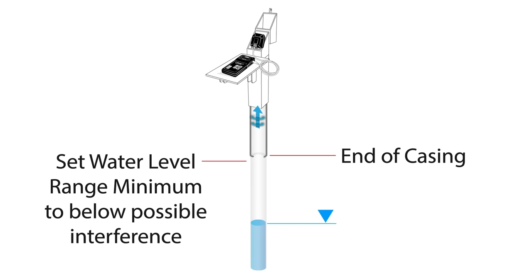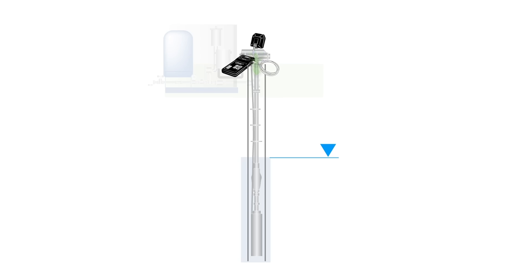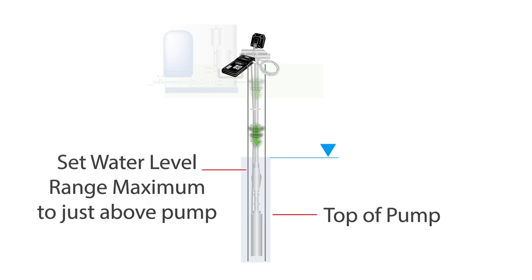It's important to note that in shallow wells, it's possible for the sound pulse to bounce back and forth many times. So without a maximum depth setting, the sonic water level meter may indicate multiple depths. In deep wells, especially with rough or porous well casing or well walls, sound waves lose energy, so the sonic water level meter is forced to increase the gain or listen harder to detect the return signal. This can result in other noise, such as a downhole pump or even surface sounds, being stronger than the sonic meter signal, thus causing incorrect readings.